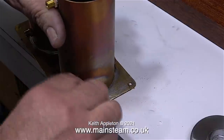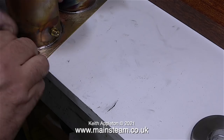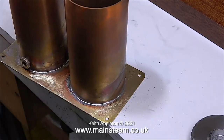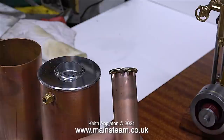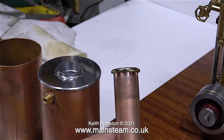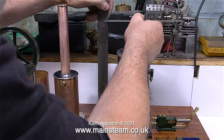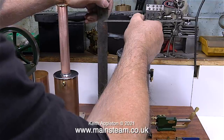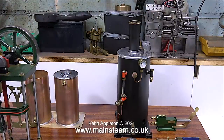Now it's cleanup time. The component that was soldered earlier has cooled, so it's on the bench for a really good scouring. First I scratch the brass as much as possible with emery cloth, then I smooth out some of the scratches and make finer scratches using Scotch-Brite. I've also polished up the brass ring on my polishing spindle. Using two steel rules — one across the top of the chimney and one placed vertically — I can see that the boiler is one foot tall from the baseboard, and the chimney on the condenser is one and a half inches higher than the one on the boiler.